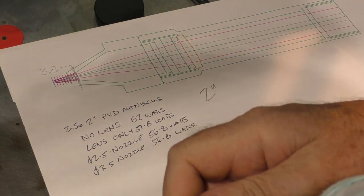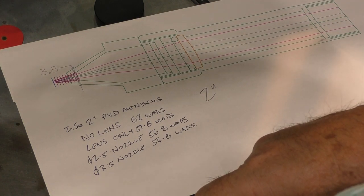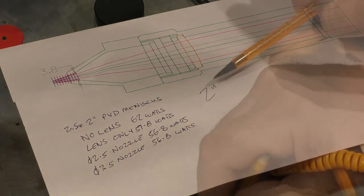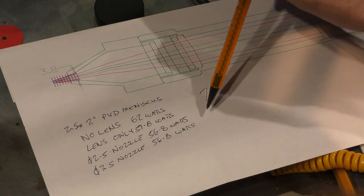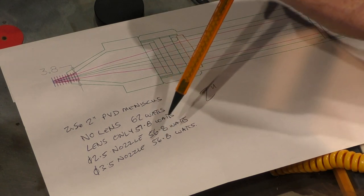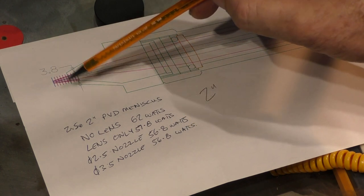So, as I suspected when I did the previous session on nozzles, it's very interesting, but they've been around a long time. They have to be that size and that shape for some good reason. Now, they work well for cutting, which is where you need all this power. I've chosen the 2-inch lens because that is typical of what most of you guys have on your machine. Now the 1.5-inch lens might give slightly more exaggerated results, but looking at this data here, I don't think we're going to see any major changes even on a 1.5-inch lens going through a 2.5 orifice.